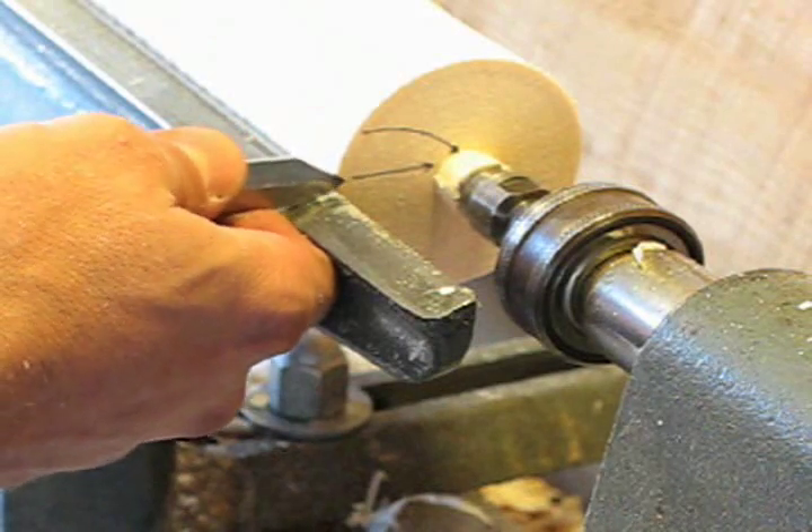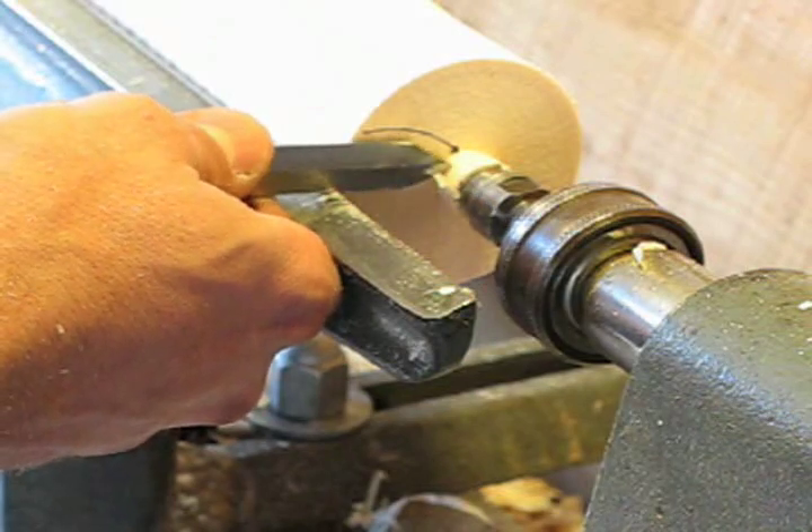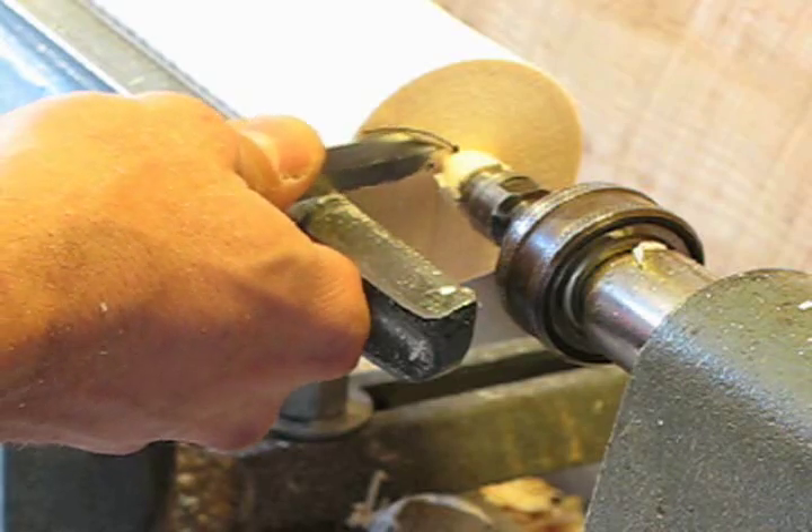Here's the trajectory of the two different cuts. The stabbing cut goes straight from the fulcrum of the tool rest into the center of the piece, whereas the shearing cut is going to travel along the top of the round as it spins, always taking a nice light cut.